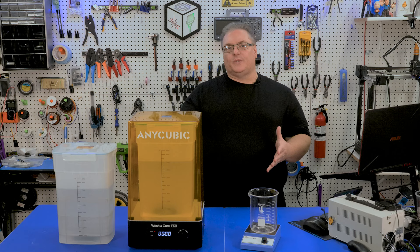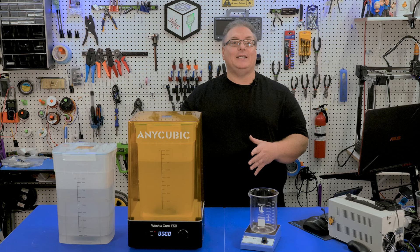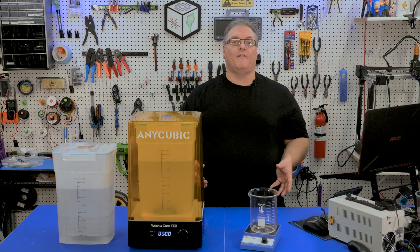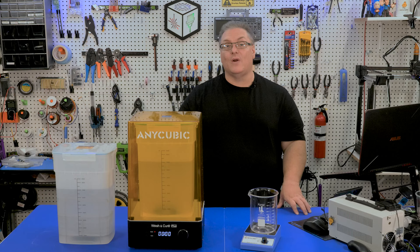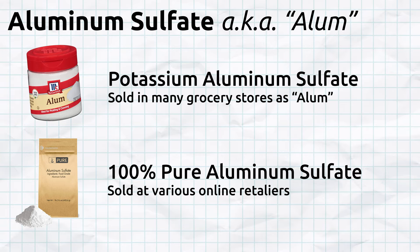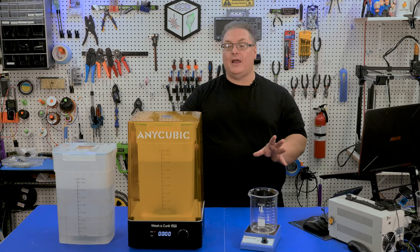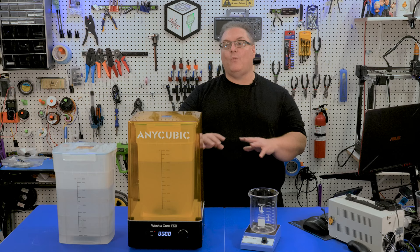Using this recycled IPA, I haven't had any problems or issues with my prints. Many of you are probably worried about diluting the IPA with the water. I believe the majority of the distilled water and aluminum sulfate is being removed during the decantation process, as water is heavier than alcohol, so we're pouring off all that good alcohol. I've used this process now on several gallons of resin and haven't had any problems, and I plan to make this part of my resin workflow. I bought aluminum sulfate online from Amazon — food grade aluminum sulfate. Often you'll find that there is potassium added to one of the formulations. I tested pure aluminum sulfate here; I did not test the one that has potassium. The ones you buy in the grocery store have that potassium, and I have no idea how that is going to react with the alcohol or the photopolymer. Through all of my experiments, I had no reactions with the aluminum sulfate when it was only aluminum sulfate.